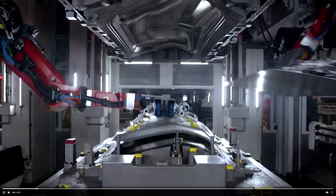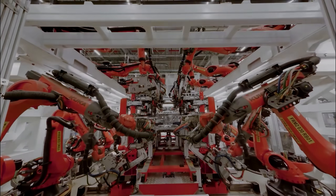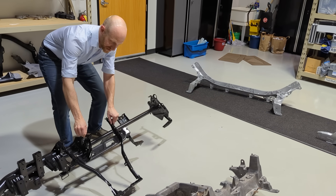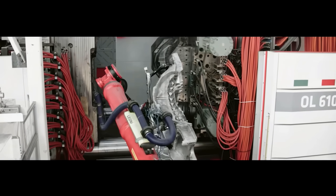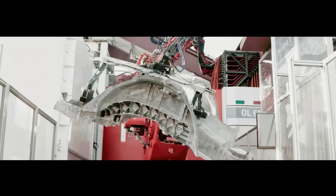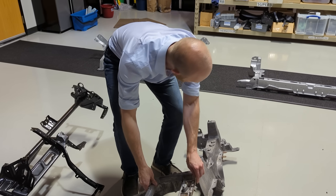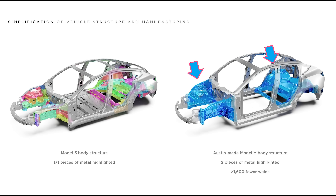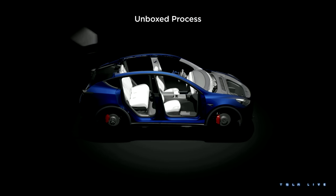However, there's another benefit of casting. With a typical steel part, the metal is as thin as possible to reduce weight, and the parts are welded together to form assemblies, which results in wobbly and imprecise assemblies that are difficult to work with. That's as opposed to cast aluminum, which is lower density and results in thicker parts, which in turn makes the overall part much more rigid. The nature of casting also means that the mounting points will always be exactly where they need to be, which makes for a solid base to build up from on the production line. That rigidity also means that the front and rear underbodies, which take most of the structural stresses in the vehicle, can be bolted to other parts like Lego pieces with fewer concerns about structural stability.